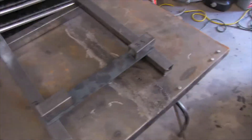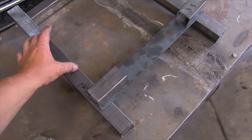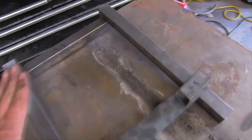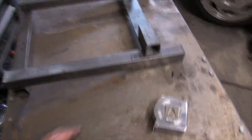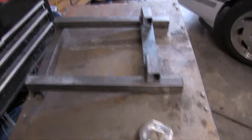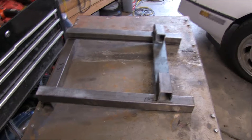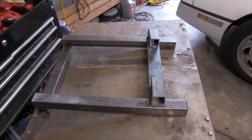This goes under the back and supports the frame — it stays out of the way of the kickstand switch so it doesn't mess that up. On the front, it positions the motorcycle at the correct angle to bring it up straight and be sturdy. Once I've got it roughed in, I'll put flat steel tabs on the sides with holes to stick the round iron bar through to secure the bike. I'll tack weld this together, check measurements, cut off anything I don't need, and go from there.